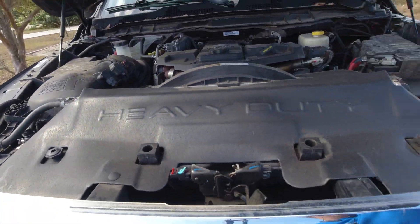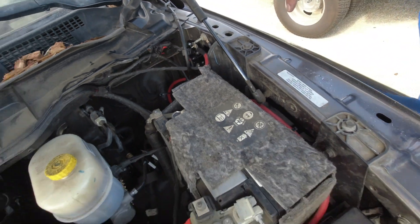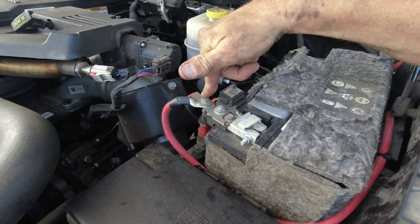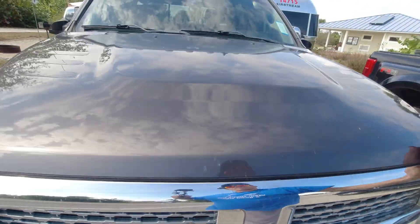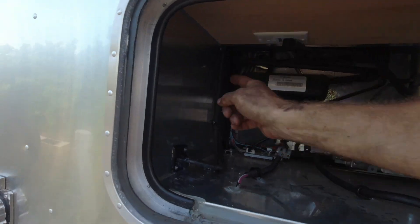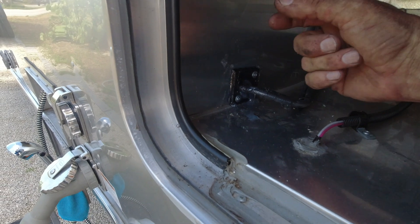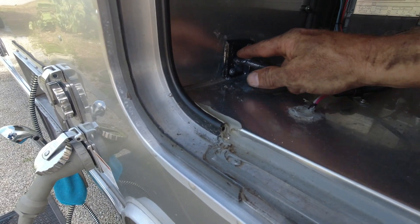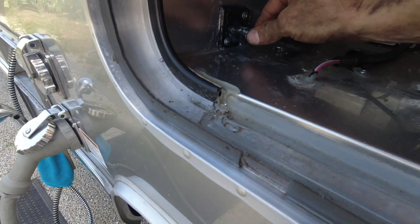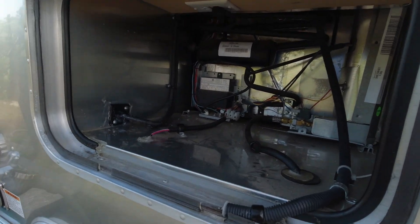We come up from underneath, come into here — a 100 amp breaker — come across and connect onto the battery terminal. Negative is grounded at the back. We also have our solar that comes down. Solar comes in from the top, comes down, goes through this — this is to keep it off of the metal. I drilled the hole larger on the metal. I haven't found a good solution for a penetration piece yet, but it's completely sealed, anchored, and anchored on the top as well.